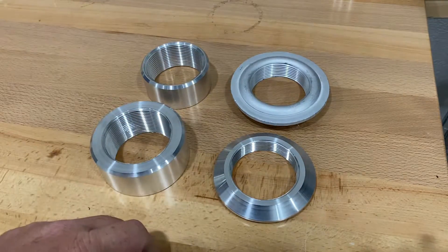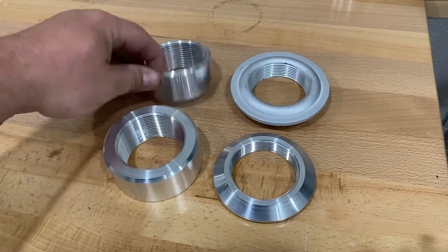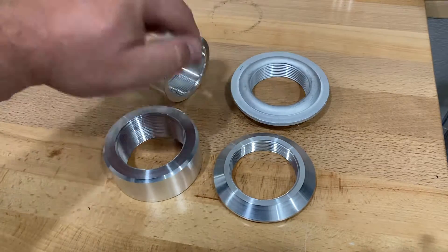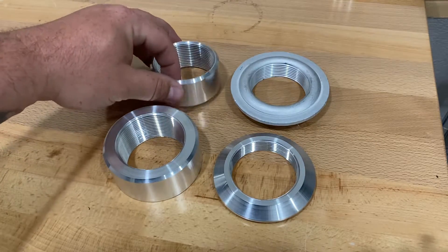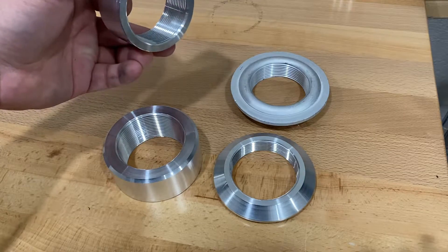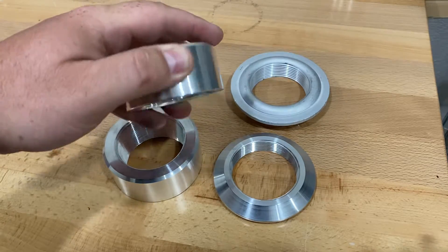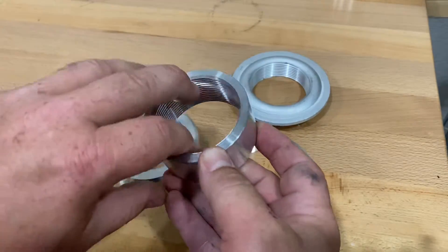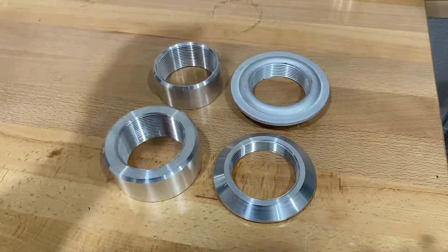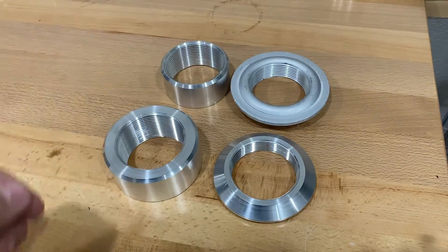Next we have what's called a half coupling — it's just half of a full coupling. A full coupling would be two of these threaded from both ends. The half coupling is a machined piece — we machine all three of these in house. It has a full profile all the way down to the bottom. You'll notice a chamfer at the top that designates which side is top, so the fitting you thread in can only go in on this side because the threads are tapered. The wall thickness follows standard pipe specifications.